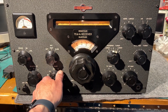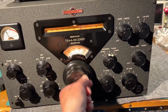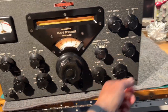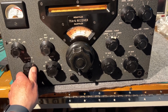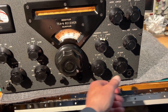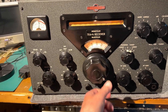Just a brief demo on AM on the 160m band. It does get the top end of the broadcast band; of course, here it goes, tuned down to 1.5 megahertz at the bottom end. The 3.1 kilohertz filter is just a bit too narrow for AM — perfect for sideband.